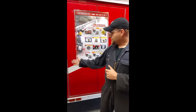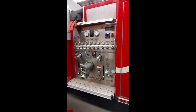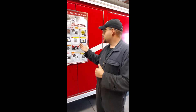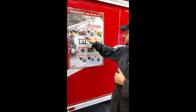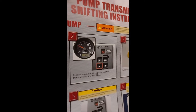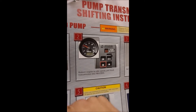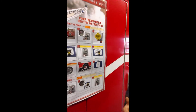The pumper we have here today is a Spartan pumper with a Waterous pump — a Waterous C series pump — and they actually make a poster which will help show you how to shift through. So if we were driving this pumper to a fire scene, the first step is to bring the truck to a complete stop, then reduce the engine idle and shift the transmission into neutral. Make sure it's completely stopped, because if it's not and you try to make the shift, you could damage something — gears trying to uncouple and recouple.